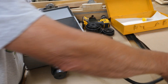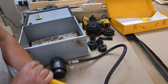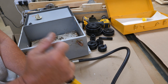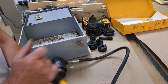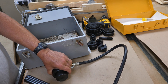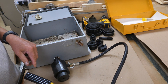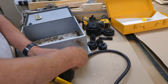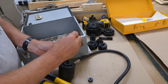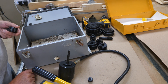These are your alignment marks - if you make a cross where you're cutting with a pencil, you can align these marks to make sure you're perfectly centered. Then it's just a matter of taking the pump and tightening the foot up. And there we have it punched. Then you just release the little wheel here which lets the pressure bleed back out, remove all of this, and there's a slug punched. So now we have a three quarter inch knockout.